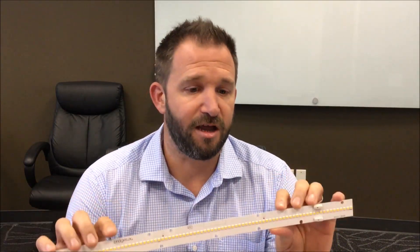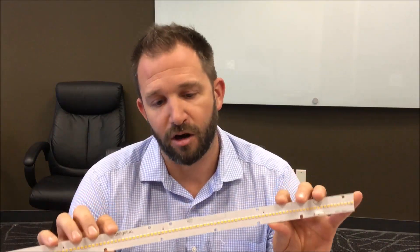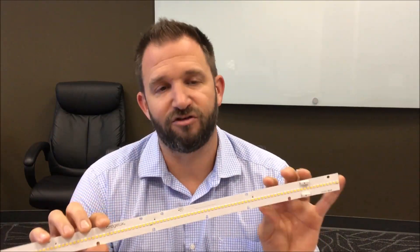The biggest upgrade for the standard product is that we've gone from our second generation 2835 to our third generation 2835. You're looking at a jump in total lumens out for the same power input, so that's an easy-to-understand upgrade. That applies across all of these products — we're moving from the Gen 2 SMD to the Gen 3 SMD — and along with that we've expanded multiple options.